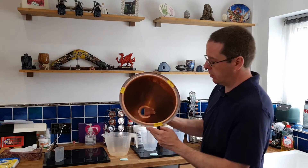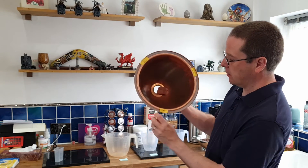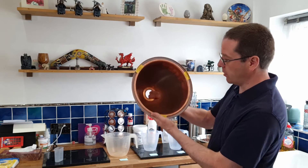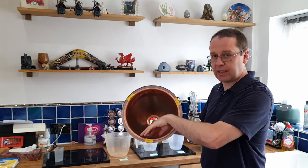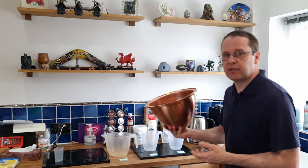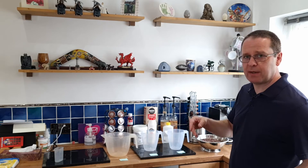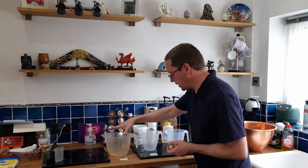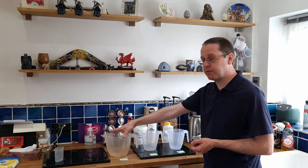For the alembic head, I've put three different little bits of tape to label what they are. I'm going to rest it and pour in a pool of just citric acid and water, clean it off, then do another 40-minute session, and another, and we'll see what it looks like. The citric acid solution will be 500 ml of water and one tablespoon of citric acid.